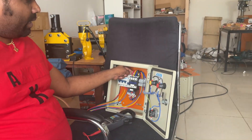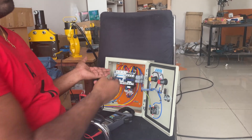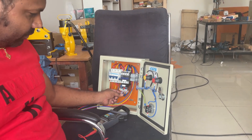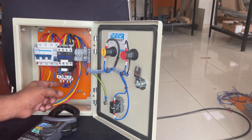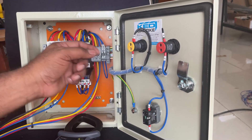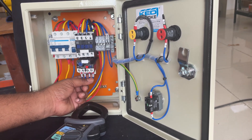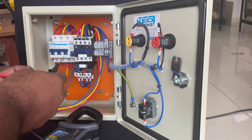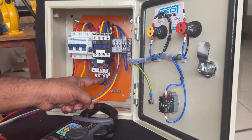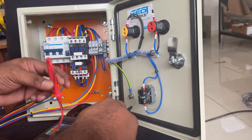Our A1 wire number is four. We have to trace back to the previous wire number. We check where the other end of wire four is, and we find wire number four on the overload relay. Also the run indication is wired here. In the overload relay, before wire four is wire three. We check whether the supply is on wire three — it is also not there. Then we check the other end of wire three, which goes to the on-off switch. The next number before three is two.